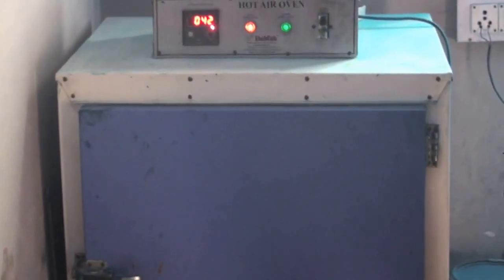After we finish up the spray process, we will put this sheet inside the oven for baking. Once baking is finished, we will open the oven. We have been hanging these plates inside the oven. Now we will leave it outside at room temperature for air drying — it will take around two to three minutes. The coating has been done on both sides of the sheet. Here we are using a 600mm oven, which is 24 inches. You can accommodate up to 10 pieces at the same time. If you want more, you can buy a bigger one, around 40 inches.